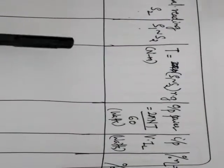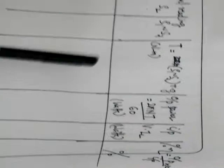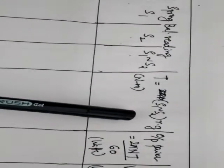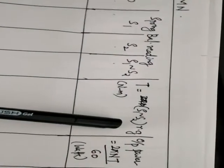The first four columns — V, I, N, S1, and S2 — are filled during the experiment. The remaining columns are calculated afterward. The S1 minus S2 difference is computed from those readings, and torque T is calculated using the formula: T = (S1 − S2) × r × g, where r is the radius of the brake drum and g is 9.8 m/s².